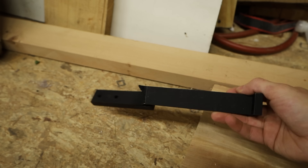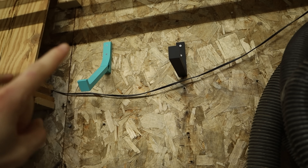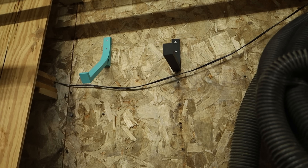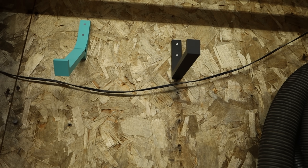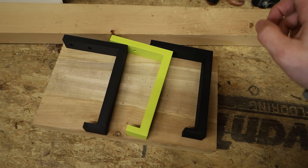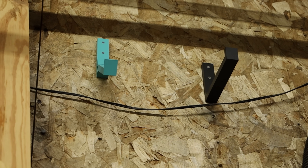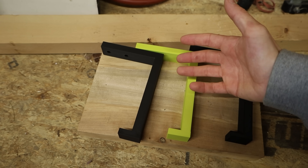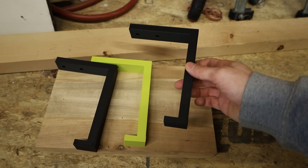Albeit I've already broken this a bit more, but essentially the exact same result — and this is the glass fiber variant. So I'm not satisfied with these results; I think these can do better. I added wall thickness to each of them and upped the infill percentage from 15% to 20%. These were designed to allow some flex so I didn't want it so stiff that it wouldn't show any results. So I've got three new versions — I'll put the regular PLA and the new glass fiber HT PLA up on the wall and give it another run.